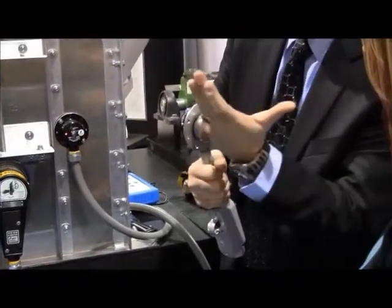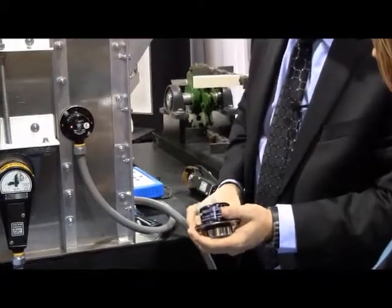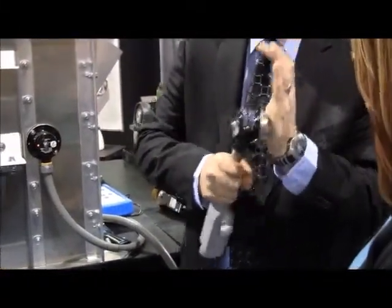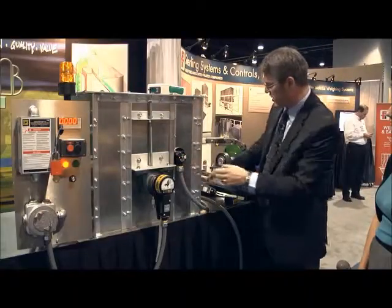this is a hardened stainless steel — it activates the sensor. As the belt comes over, it's not heat generated, it's force activated, and that will give you an alarm and a shutdown. Here we have one mounted on the side of the elevator.